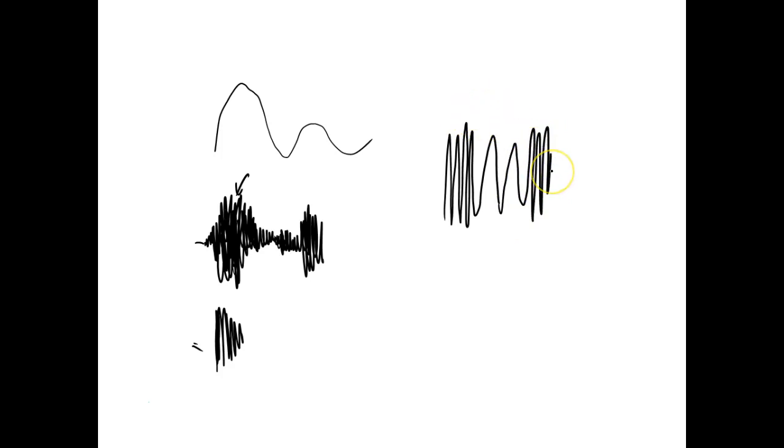So frequency modulation: the amplitude of the signal we're trying to modulate changes the frequency. And when you set up your radio, you're tuning in the frequency of the carrier, right? I go up there and put my radio on 93.7 megahertz. That's the frequency of the carrier that radio station's sending out. And we can set up what we call a tuned circuit, which only lets the carrier come through and blocks everybody else, right? You understand? So that's the beauty of modulation.